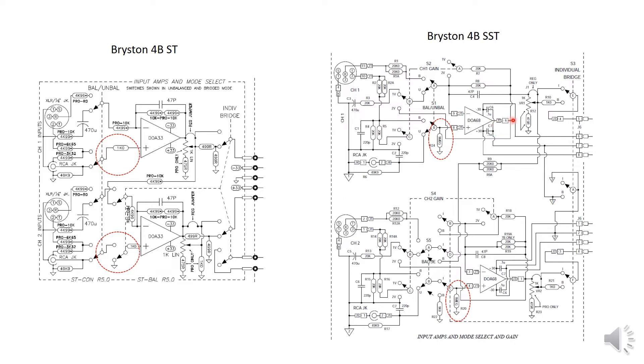That ensures the output is always at zero potential. If you lose this ground connection, the output could swing to a very high voltage due to resonances or whatever occurs. That voltage is transmitted directly into the power amp, resulting in overload of the last current stage — basically your transistors will carry extremely high current and burn. The offset at the output stage could also damage the speakers.